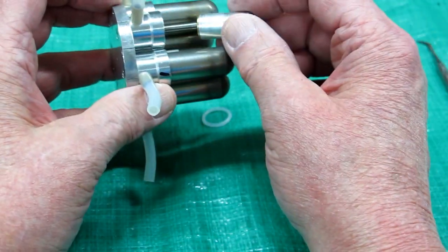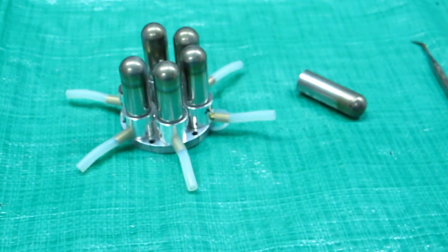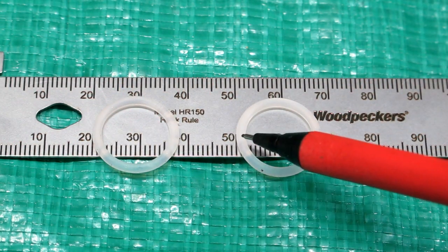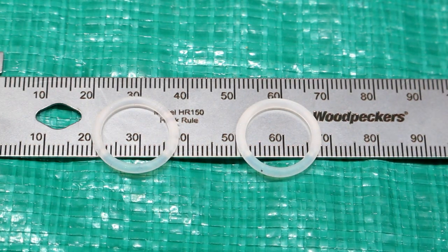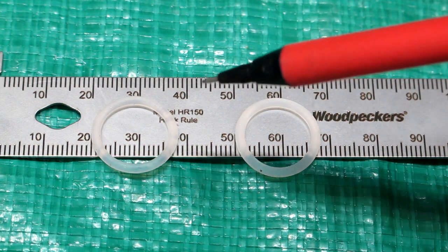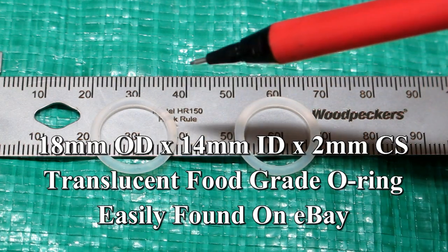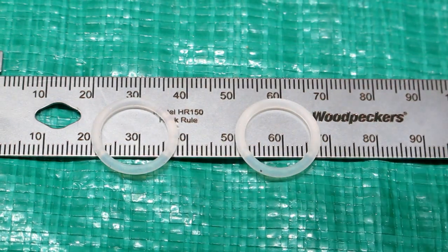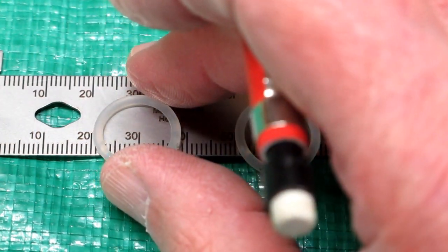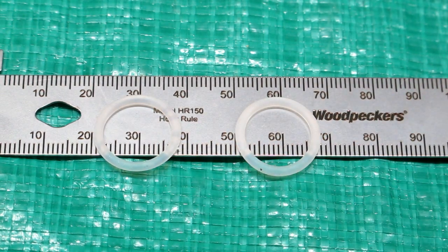I feel for any burrs. I'm just going to have to check each one and see if I can find any lint or dirt or anything that's inside. This is an o-ring from the displacer tube, and this is an o-ring off of the liner that seals the cylinder head. They both appear to be the same - on the ruler here they appear to be 18mm OD and 2mm diameter. This o-ring off of the displacer has little shiny flecks on it - metal dust. Might be some debris from machining.